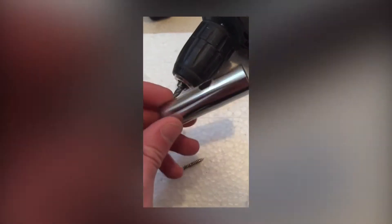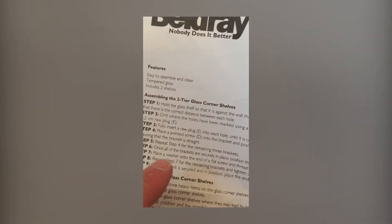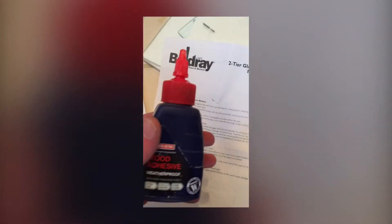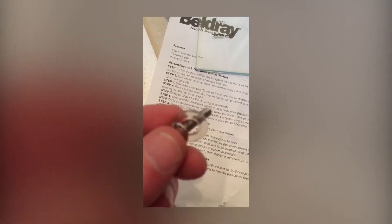The rawl plugs kind of fit - they're stiff. That's in, and they're both in. I've got two bottles here - wood adhesive. That is all just rocks, that's pretty hard. A little bit of that, and how we go about screwing that in - that goes into this. The plug is in far enough. I place a washer over the end of the flat screw and fit it with a little bit of this stuff in the hole, and it just winds itself in.